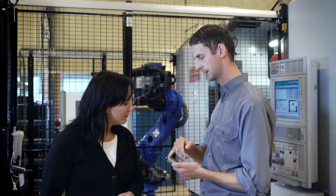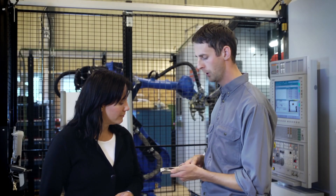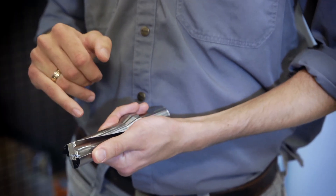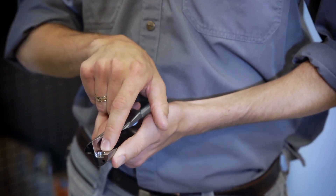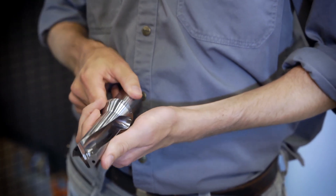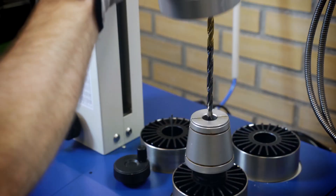The next operation is probing. Then we open up the front flutes by using a turbo cutter. The next step is to make the pockets where we use solid end mills. For the solid carbide tools we use shrink fit holders to minimize the runout and improve the quality.